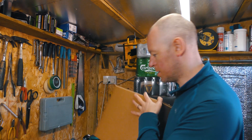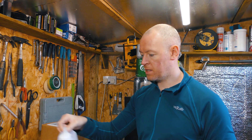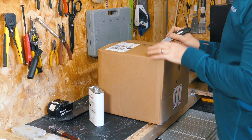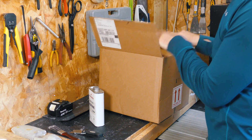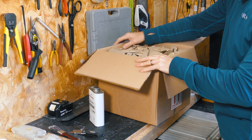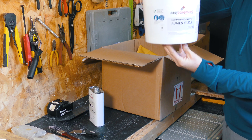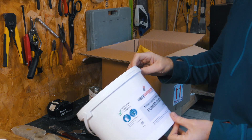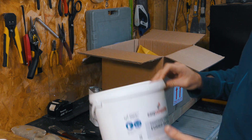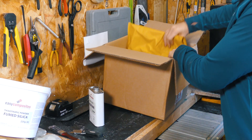I've had to buy more supplies. This is from Easy Composites again. They are now out of stock of laminating resins and gel coats and stuff, so I bought up before they ran out. So this is something called fumed silica, which apparently is horrible toxic stuff and you don't want to breathe it. It comes in a very lightweight box. This stuff is a very fine white powder. You mix this in with your epoxy resin to make it thicker — to make something called peanut butter — and that helps sand it.